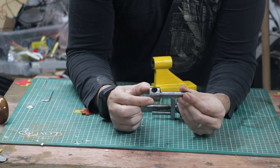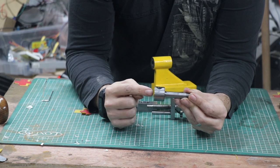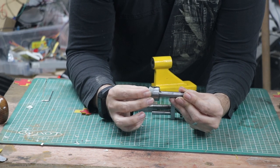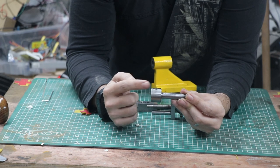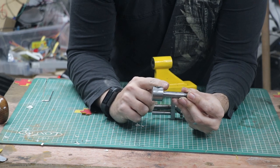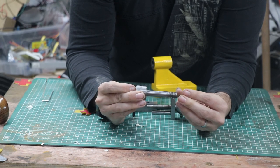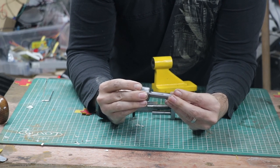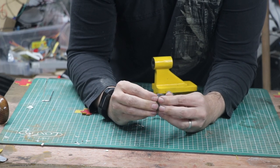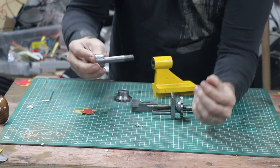What was interesting about this was I originally saw this kit in an Adam Savage video, and I'm pretty sure he got these components the wrong way round. The design very specifically has you machine these up, bore through the hole, and then trim a little off of the inside ledge so that when the nut screws on, it pulls it tightly - offset just enough. Like, you can't over-tighten it, but it has just enough to be able to squeeze on the main arm.